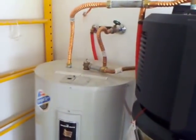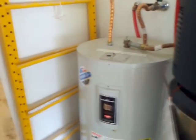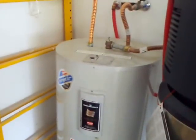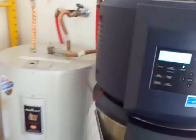That's it — two water heaters hooked up in series. The old water heater is working as a tempering tank. I have some future ideas of running some solar heat in there, or some type of other heating system that doesn't use any power from the house. I'll keep in touch.